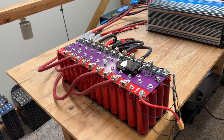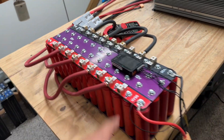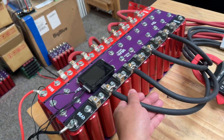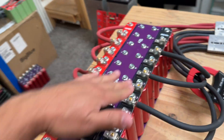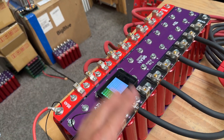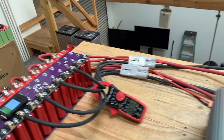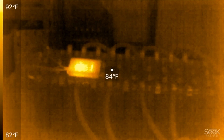Time to test the 96-amp Headway battery pack using the PCB bus bars. We have it wired here with four 2-gauge wires spread out evenly. We're going to load it up with as much as 800 amps, depending on where the cells sag below 12 volts. We have the thermal camera recording, so let's start that recording now and load up the loads.